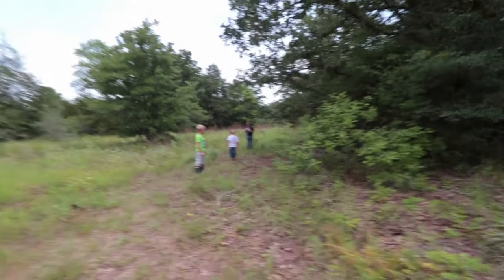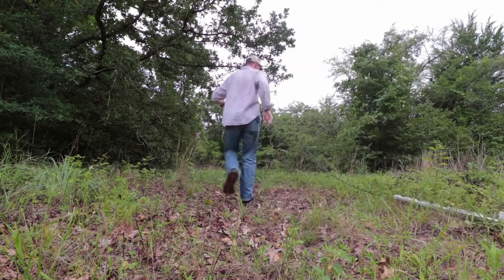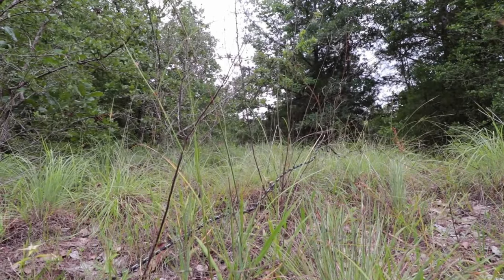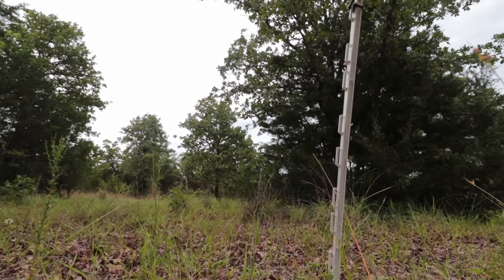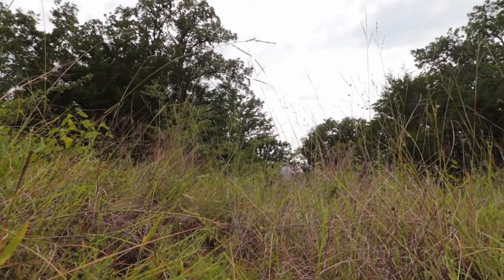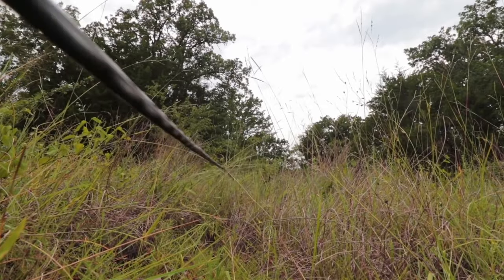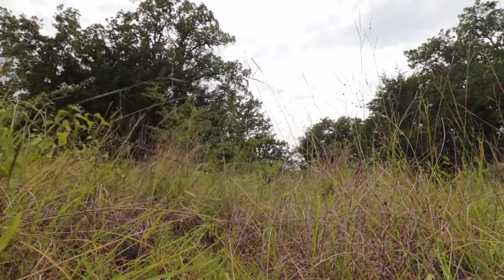At the time I didn't have access to all of my tools, so I did something kind of weird. I called up the tractor supply and bought a hundred-foot rope — that was my measuring tape. I put it on two little stepping posts, strung it all the way out at 100 feet, then moved it along to measure around the trees and across our driveway. I was able to determine I needed at least a 200-foot run for our electric and a 400-foot run for our main water line.